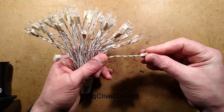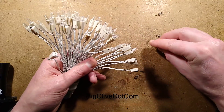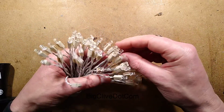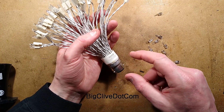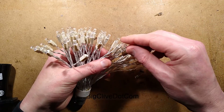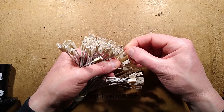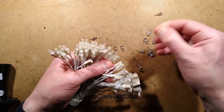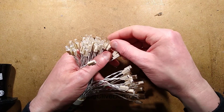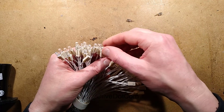I'm not sure how well this is going to work. I'm just going to start pulling the LEDs out of it. I was going to fit it with colour changing LEDs so that it gradually morphs over its whole surface, but I know it's going to have a couple of quirks. The technology I used in this - a capacitive dropper, a bridge rectifier, and surge limiting resistor - that's it. There's no smoothing capacitor, which means it has a very slight shimmer. If I use the RGB colour changing LEDs it will potentially cause it to reset because those colour changing LEDs go through red, green, blue, cyan, magenta, yellow, white and gradually repeat. They don't generally like being put on unsmoothed supplies because they can't hold their position in the programme - the little counter inside keeps resetting.